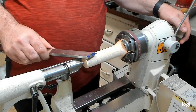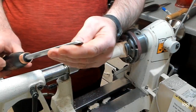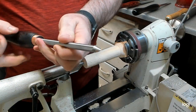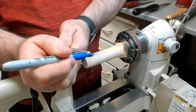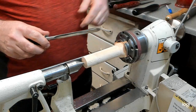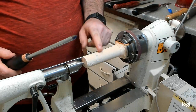What I'll do is turn it on. We're not going to bother with the skew today. But what I want to do is just show you a spindle gouge. This spindle gouge has got quite a long bevel. So what I'll do is I'll just colour that in with sharpie so you can see. Then what we'll do is we'll look at that piece of pine and we'll see the difference. As you can see, it's very, very rough. So as we turn the lathe on and I ride that bevel, I'll take a couple of passes because it is rough. And then it'll be super smooth, or a lot smoother than what that is.